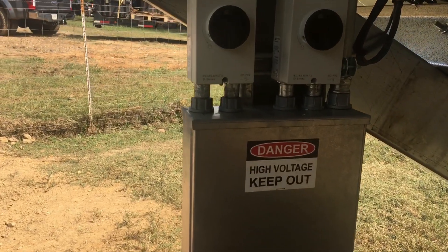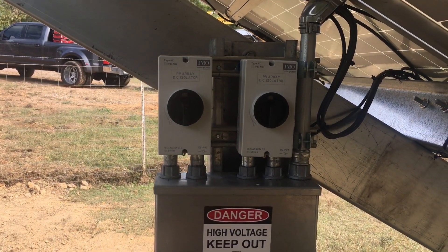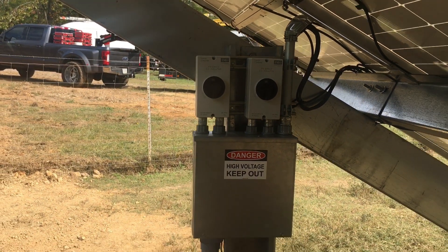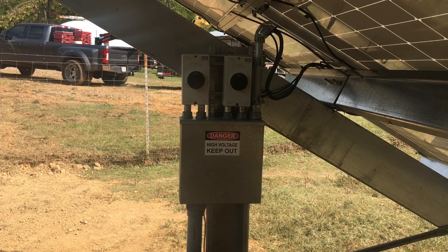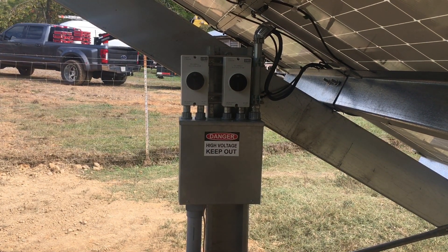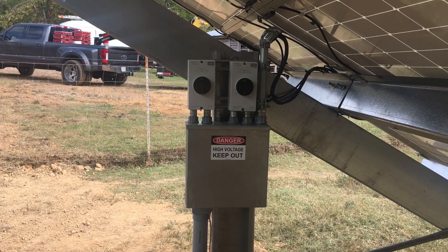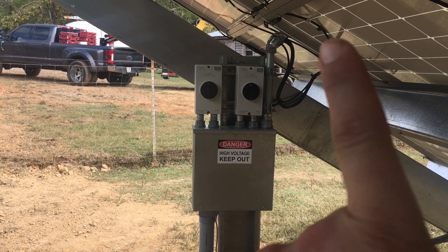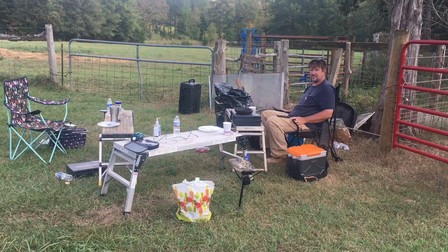Here's our disconnect for our two solar strings. You take those two solar strings, both operating at around 9 amps, combine them — seven panels per string — then combine two strings, and they go all the way back to the house. These are IMO disconnects — high-voltage DC disconnects. You can see where we've got our solar wire going in through a weather head.